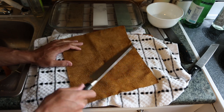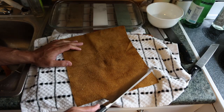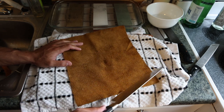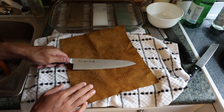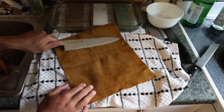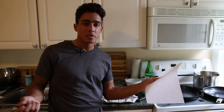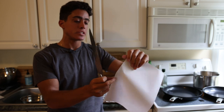When you rub the leather on the knife, it fills in the burrs on the edge. Burrs are tiny metal imperfections left from sharpening on the stone, and the leather fills in those holes and makes it really sharp. In old-school barber shops you'll see the barber stropping a razor blade on a leather strap — they actually sell leather strops. This was just a cheap piece I found, but honestly this is kind of overkill unless you're shaving your face and you've done a really good job on the wet stones.